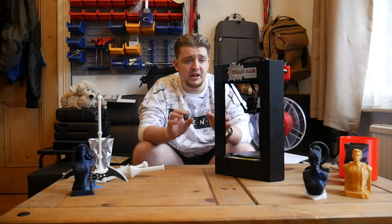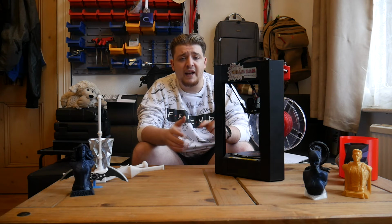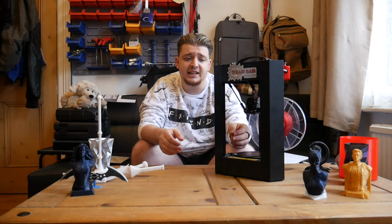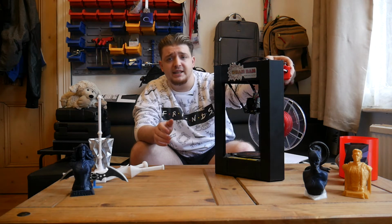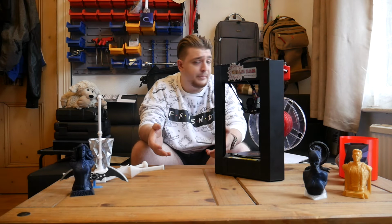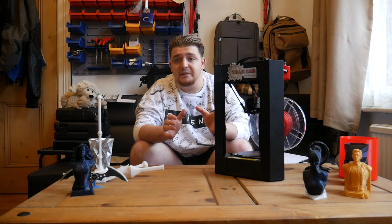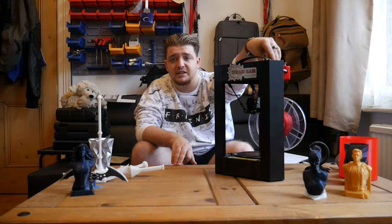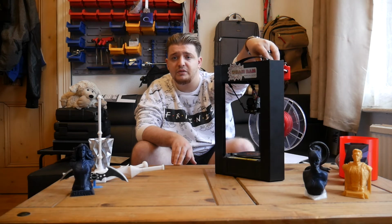And lastly, now that I'm at this point where I've had all these failures and I've had to change all these things, and I've had to adjust the tension in the belts with an Allen key and a guitar tuner app, where I've had to replace the extruder motor and the extruder itself, where I've had to change the E-steps on the printer and then save it in my G-code start script because I can't save it to the EEPROM, because the printer makes prints that are 2% too small on purpose. All of that inconsistency is bad. And I'm at the point now where I say you've sacrificed too much of the experience to get this as plug and play, where you should be considering other printers for this price range.